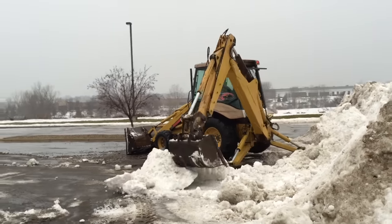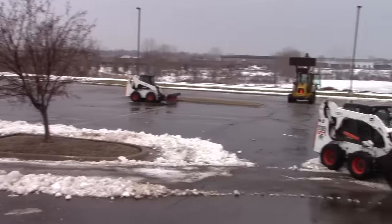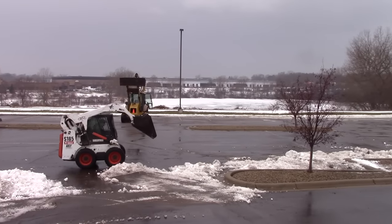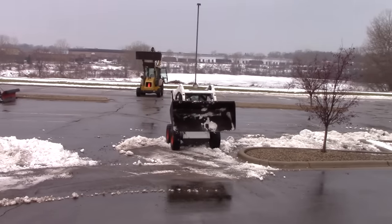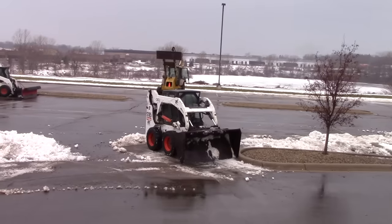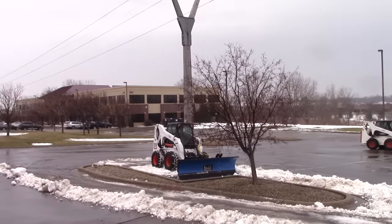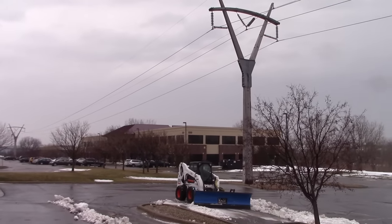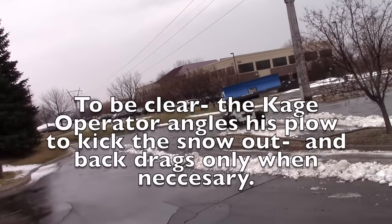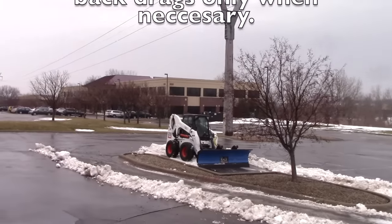This event was the cage against a bucket, removing snow from a curb line. On our accounts, we have zero tolerance for snow above and beyond the curb line, so the way we typically have to do it with a bucket is back drag everything away so that we can then angle the machine to pick the snow up without getting any beyond the curb line. In a situation like this, you would think it would be smart just to put the edge of the bucket along the curb line and plow forward picking the snow up — but when you have zero tolerance for spillage over the curb, you cannot do that. Everything must be back dragged away, and both operators are doing that in this event.